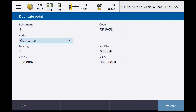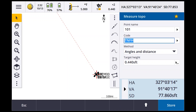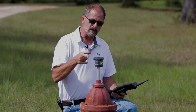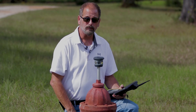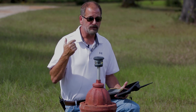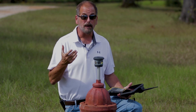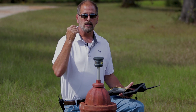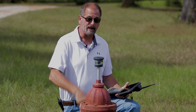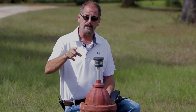All I've got to do is say Overwrite. Now if I go back into Measure and go to Measure Topo, point 101 — there's our elevation. As you can see, the fire hydrant was 200, so that's what we're rocking right now. That's how you change the elevation back on the gun. If you were shooting a finished floor, a fire hydrant, a railroad spike, a cotton picker spindle on a power pole, or a nail in an intersection, you can do that to pull the elevation back to the gun without having to run levels. Hope that helps — as always, like and subscribe, be careful out there, God bless, and I'll see you guys in the next video.